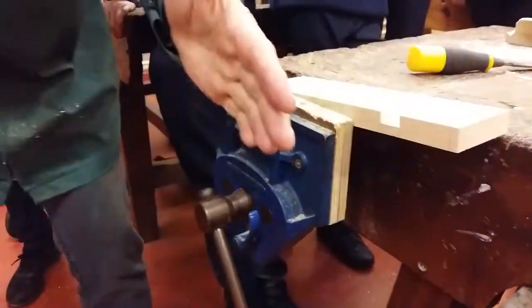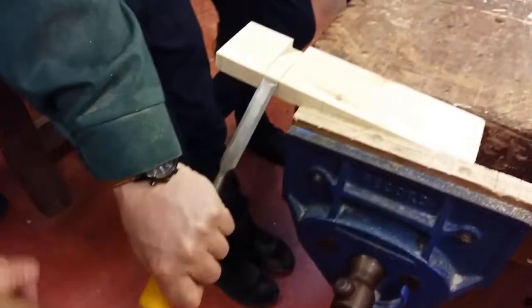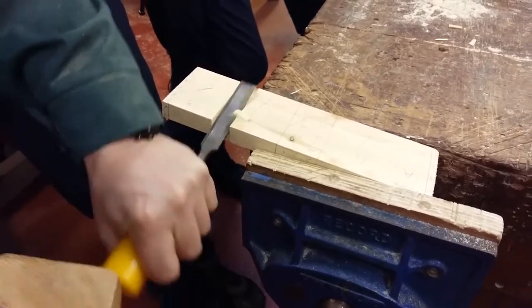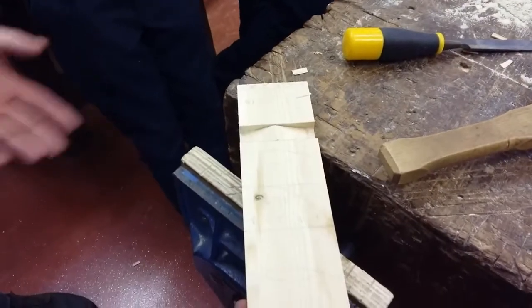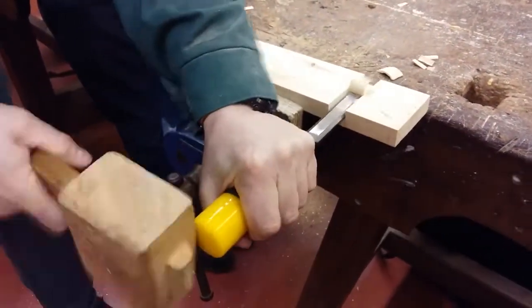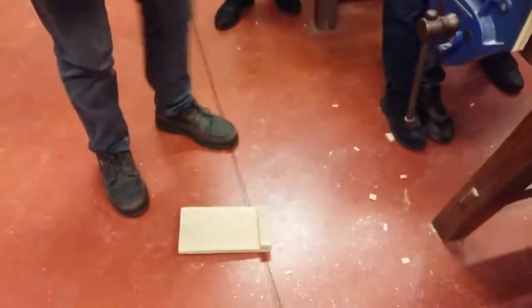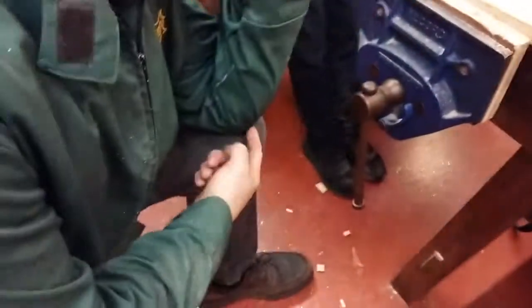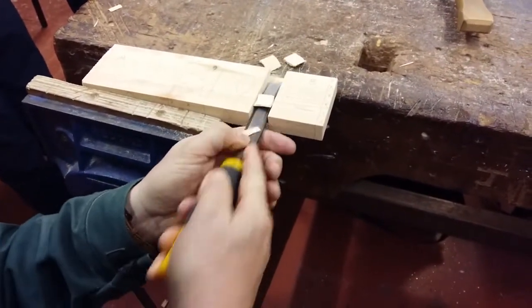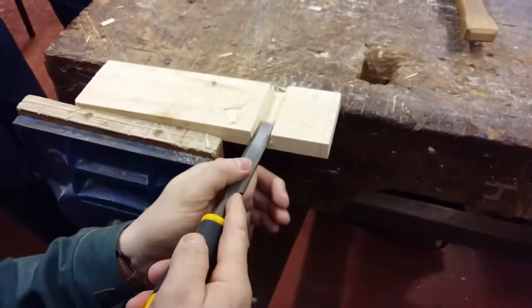Keeping the chisel relatively level to the piece itself helps you work cleanly. I've turned it over to the other side — again 90 degrees to the side of the piece, not square onto the piece — and I do exactly the same thing from the opposite side, working up towards the middle. You can see it's worked up from both sides. Whichever is my best side, I start to work from that again. I place the bench hook on the ground which elevates my knee, put my left elbow onto the top of my knee, and position myself at a comfortable angle to the face of the piece.